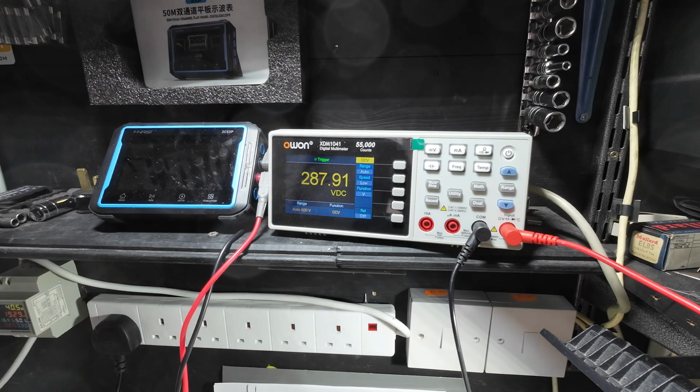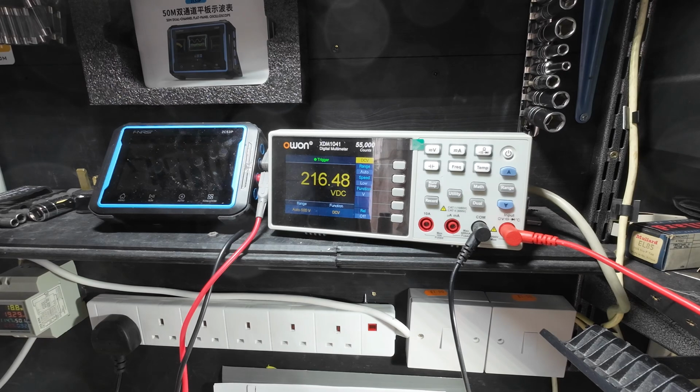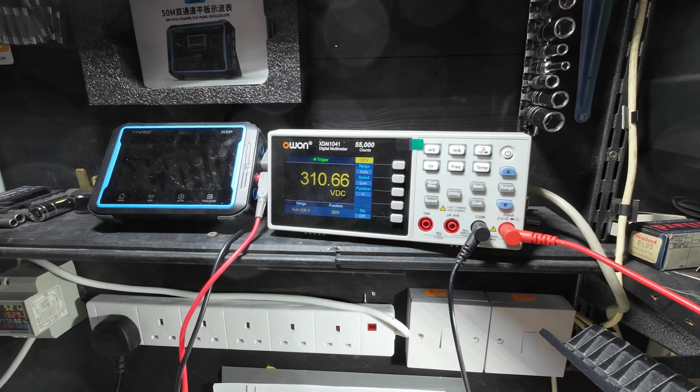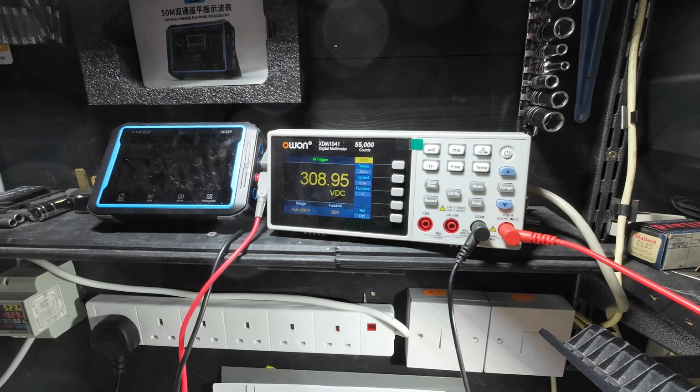Let's get another bulb in and get some more plate volts in there. So I'm going to put 100 in there now. We'll have 160 watts of bulbs, and that's going to bring it up. Should get a lot more volume. 320 milliamps we're drawing now off the wall, and the plate volts is 308, dropping slightly.